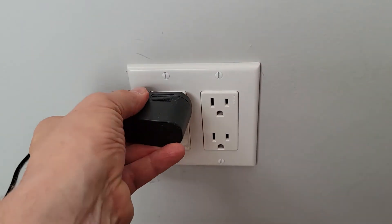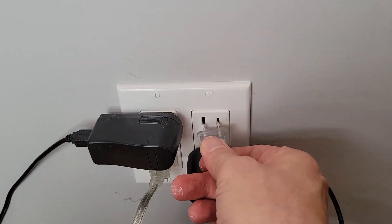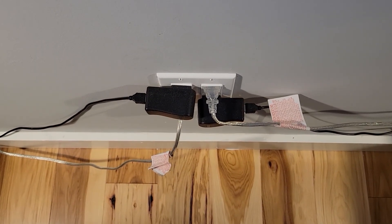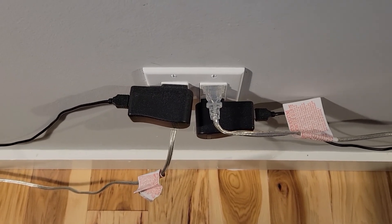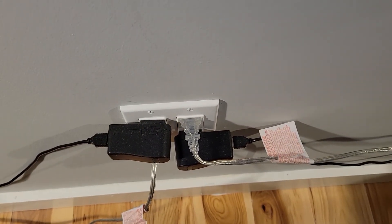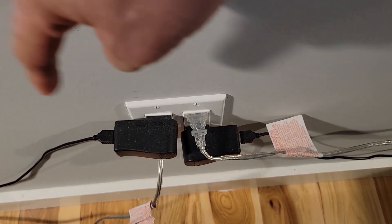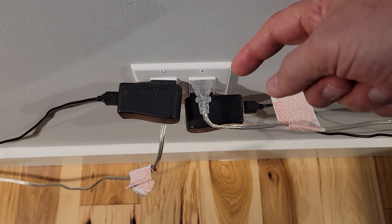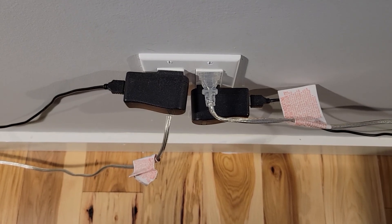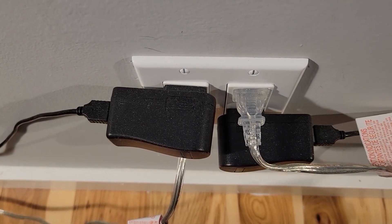Now I can plug in all our appliances here without the need for an extension cord. This project started out as a way of repurposing some leftover parts, but we quickly ran into an anomaly when we discovered that the old receptacle had power coming in on one side and on the other. We used that to our advantage by wiring this receptacle to one side of that power and that receptacle to the other side. Normally, what you would do is use a pigtail, take the power coming in, and split it off to both receptacles. If you found this video interesting or useful, give us a thumbs up, leave us a comment, join the subscription team, and as always, thank you ever so much for watching.